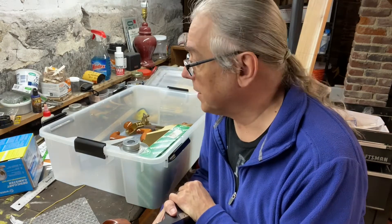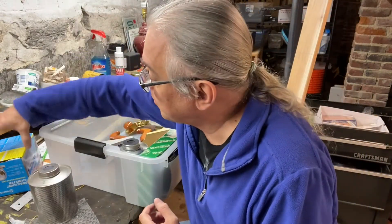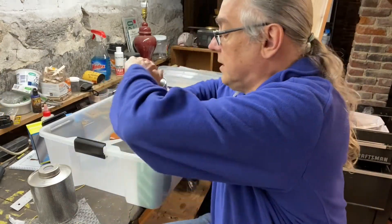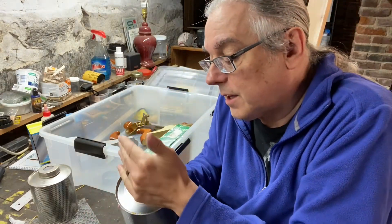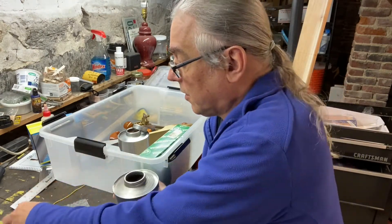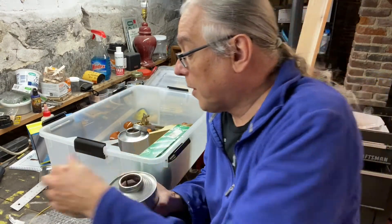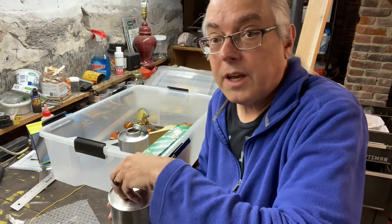I got these tools from my father-in-law less than a year ago. I've been storing them in plastic bins with a desiccant in them. The desiccant stuff is kind of cool — it's put out by a company called Wise Orb. It's silica gel beads. You can see it's orange here because this is a brand new pack. After it gets exposed to moisture, it turns a dark green, almost black. And that way you know to recharge it — you recharge it by popping it in the oven and taking out the plastic covers for a couple hours, and it turns orange again.